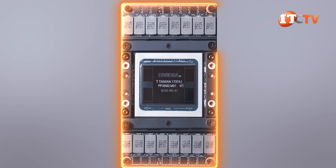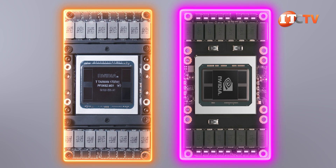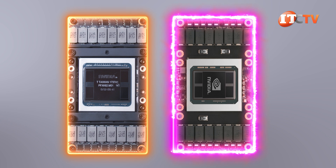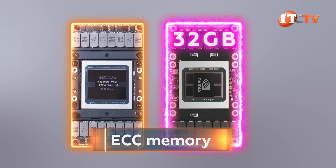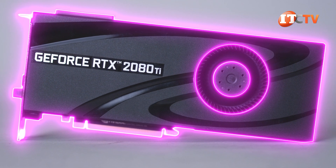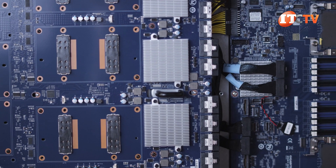A short word on the GPUs. Those SXM2 GPUs are the bee's knees when it comes to performance. The system will accept both the NVIDIA Tesla P100 featuring Pascal architecture or the Tesla V100 featuring Volta architecture. Our system is outfitted with the NVIDIA Tesla V100 GPUs in SXM2 form factor. The V100 is quite literally three times faster than the Tesla P100 and is also available in 16 gigabyte and 32 gigabyte versions. The Tesla P100 and V100 have ECC memory, which is not something you get with RTX and Titan versions. There are also no tensor cores or Volta architecture on RTX, and with no ECC, the system is unable to alert the user to single and double bit errors, which can drastically skew results for high-precision applications.